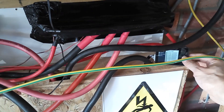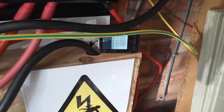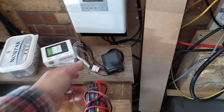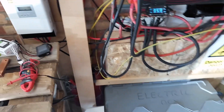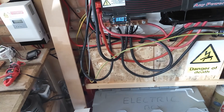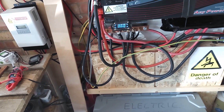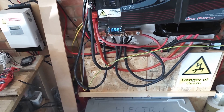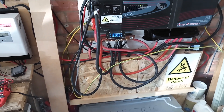I've got the little BMS thing here so I can see what all the cells are doing. For some reason that left-hand one isn't working — I've got all of the harness that I've wired up, but pin 5 on the Molex connector is putting out an incorrect voltage, so I think there is something amiss with the connection to that particular series of cells, which we will investigate at some point. For now they are passively balancing.